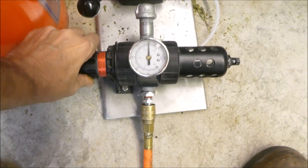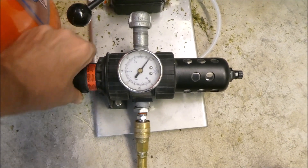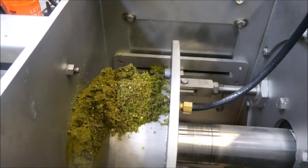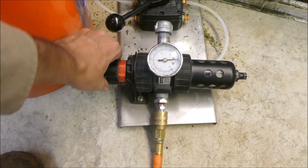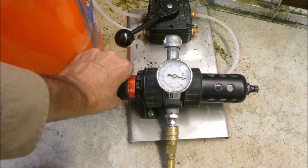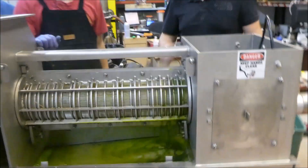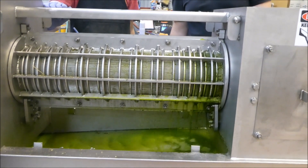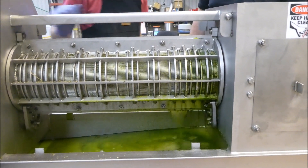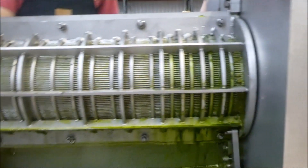How's that cake? Is that a little bit drier? Yeah, it is. I'm going to turn this up — I've turned it up to 60. How much press can we get out of it? How high can we run the pressure? All the way. What kind of pressure do you have coming in? 100? This is about 80. I'm running 80 now. You're not going to break anything, and you'll get more dewatering.